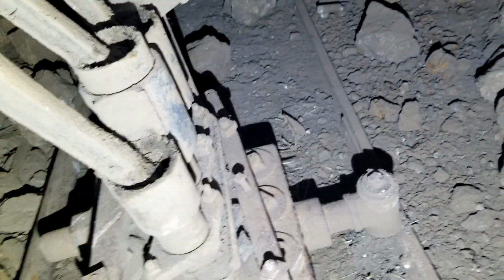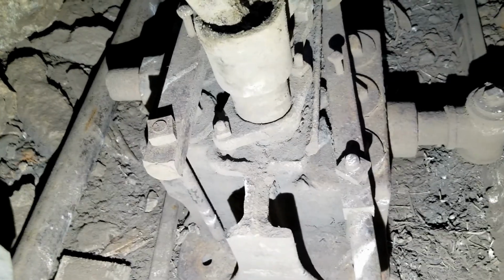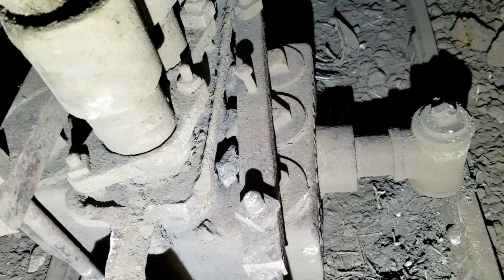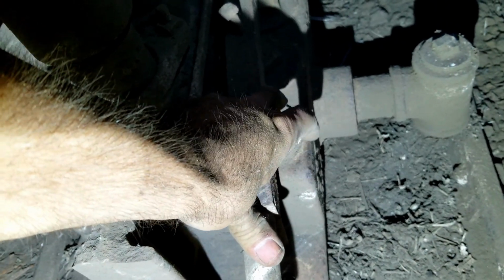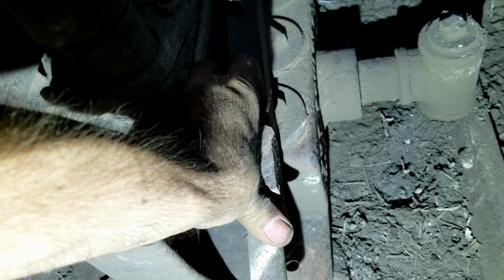Now, you'll notice, those of you that are astute and work in plumbing, that they look like about a 2-inch clean out, and they're a threaded fitting. They got a 1-inch square nut on the top, or cast square, so that you could get them on and off, and that's so that you could replace the springs, the flanges, the seals, and whatnot, because they do wear out. Well, it looks like in one of their repairs, they may have stripped a couple of them, or maybe perhaps through vibration or water hammer, it caused the threads to become boogered or damaged on the top here.